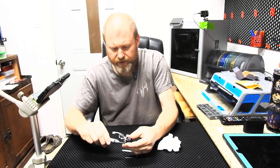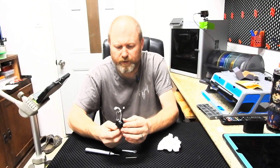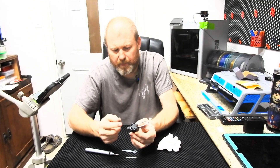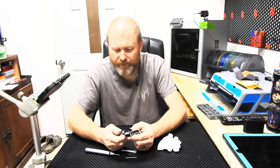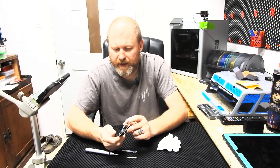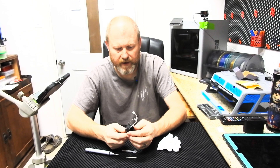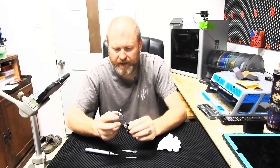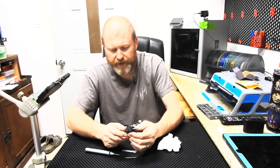So I see that we can change nozzles in these, but I also see how much of a pain it is to go through all that. Granted, you can just pull this out, pull the sock off, take that out, put a new nozzle in and put it on. But these kits are so cheap — I got this off Temu, I think it was $12 for the whole kit. I may just buy two or three more of these so I have a 0.4, a 0.2, maybe even try out a 0.6. But this is back together and ready to be installed in the printer.